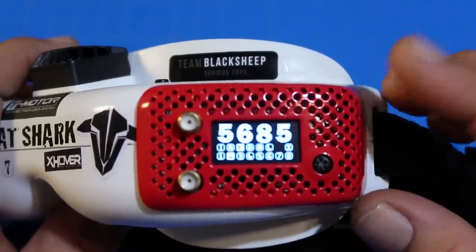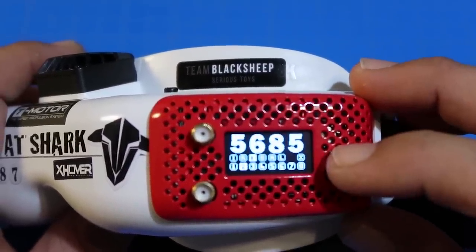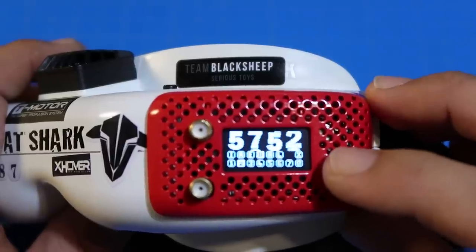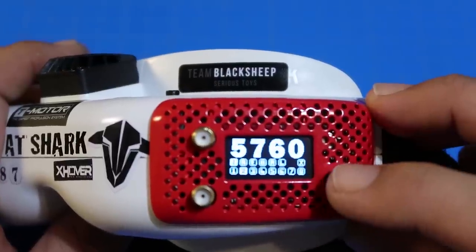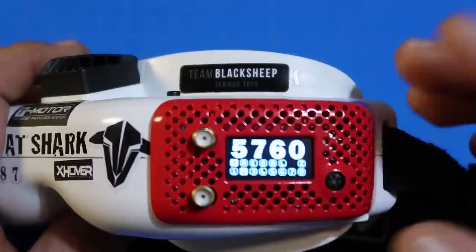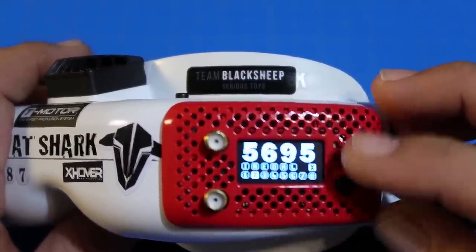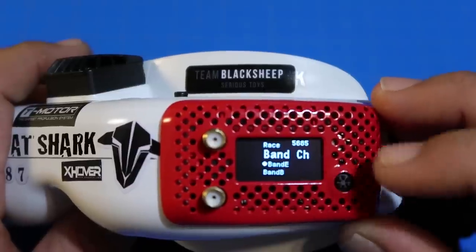Let's plug it in and take a look at how this works. On the main screen, you have your FPV frequency quite large, and below that there's a row of letters and numbers denoting what band and channel you're on. To change bands, you simply move the joystick left or right. The bands are laid out a little bit strangely — instead of ABC, you've got I, which is actually F band; R, which is race band; then E, B, A, low band, and X band, which is basically a configurable band where you can set whatever eight frequencies you want — kind of like a favorites. When you press the joystick, you enter the menu.